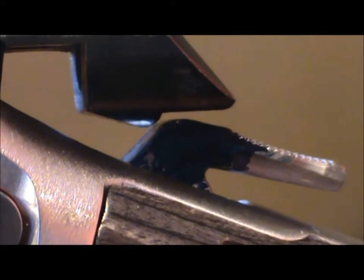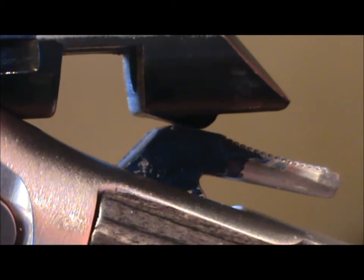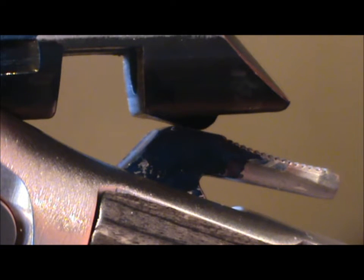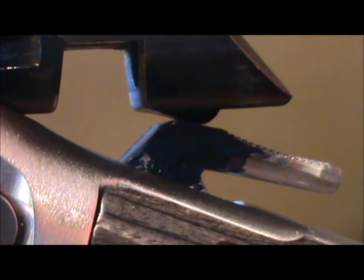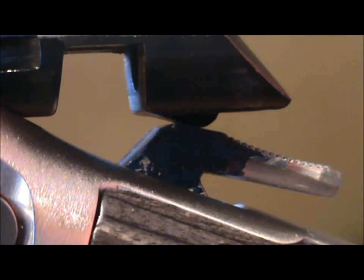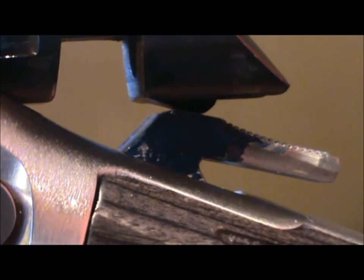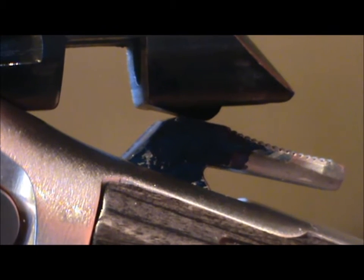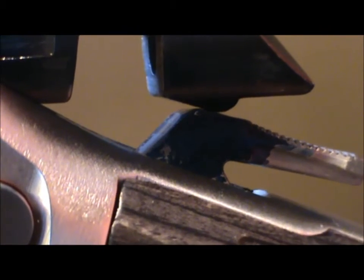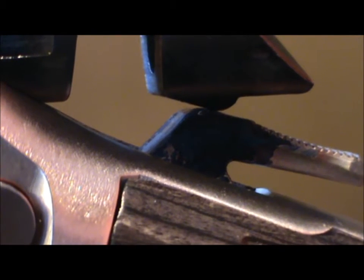It's very easy to close it this way - easy - but when I try to cycle it fast like shooting, it goes over real smooth but I get a little dipping in the gun because of the sudden bump. My theory: go easier, not that steep an angle. A shallower angle is better if I'm going to shoot and need a follow-up shot. I don't want the gun to dip down, I want to keep my sight picture. I'll see what I can do about the angle and stop when I go too far.